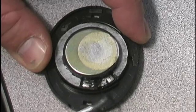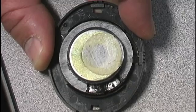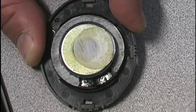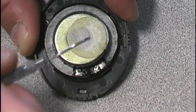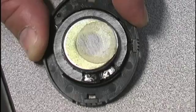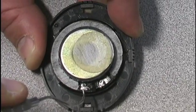It's a fairly large area so it'll be easy to solder. But what happens if I leave the soldering iron on there too long? It'll melt the voice coil. Inside this structure there's a real small wire looped, and if I leave the heat on too long it'll melt. So I need to be as quick as possible to solder these two sections on.